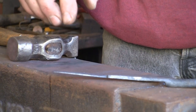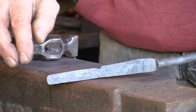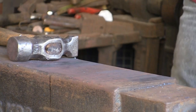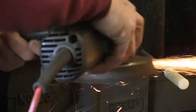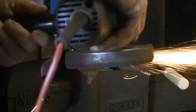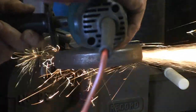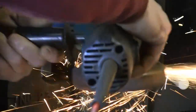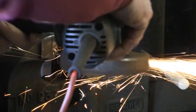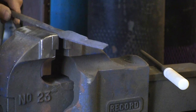You can see now I've got it fairly thin and flat at the back. I'm going to get it sharpish before I curl the end up — the business end — because it's going to be much more difficult to try and sharpen it with the curl on the end. I could really have done with it being a little bit thinner in hindsight, but I think it'll be alright. If I can get the business end reasonably tight, I don't think it'll matter that the blade itself is fairly wide. We'll soon see when we come to use it, because I will try and do a video of using it first time out, like I did with my general purpose farrier's knife.